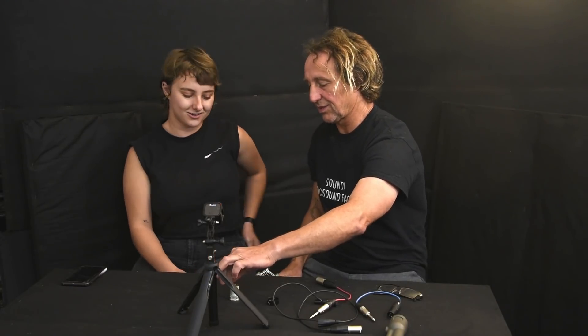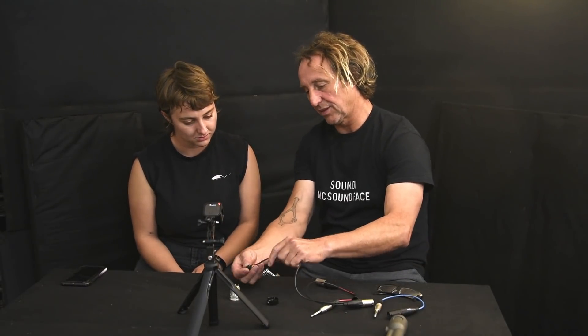So those are pin 2 and 3, and that's pin 1. Pin 1 is ground, 2 is hot, 3 is cold but it's also a hot wire. It's in polarity, out of polarity, and ground. I always remember it as — when I'm soldering these I go 'twed': the second pin is red. Ground is 1, 2 is 'twed,' 3 is the other one.